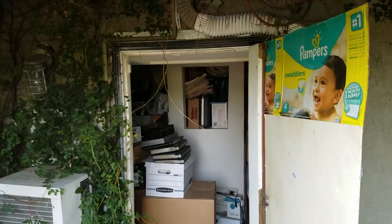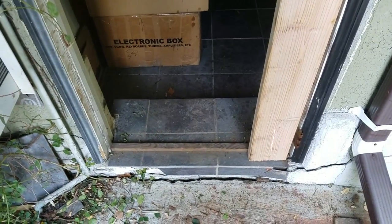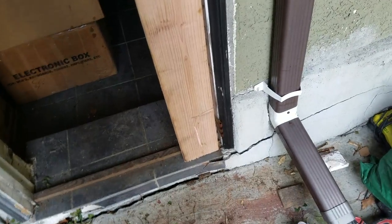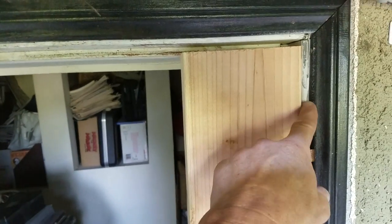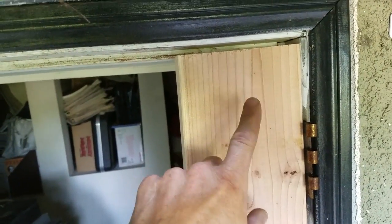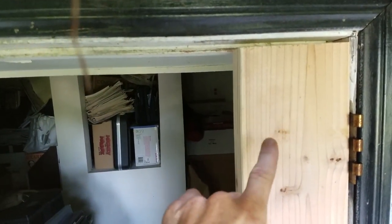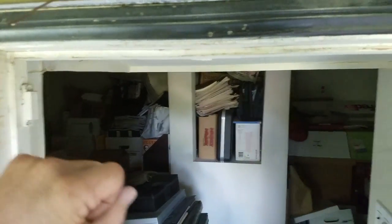Since my height is 61 inches, I want to subtract 3/8s, so I want to cut my stiles to 60 and 5/8 inches, which is what I've done. You can see I've got about a quarter-inch gap. Since this is 28 inches wide, I've got a 2x6 on each end — each one is 5.5 inches, so that's 11 inches. 28 minus 11 is 17 inches, so I want to go 17 inches minus 3/8 of an inch.